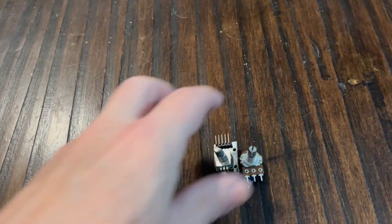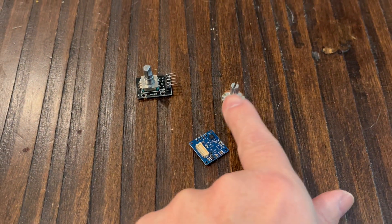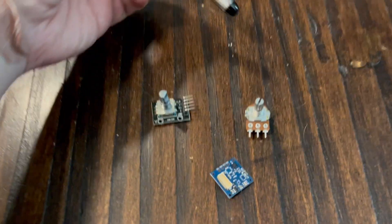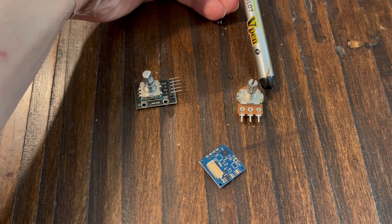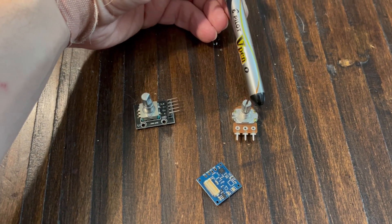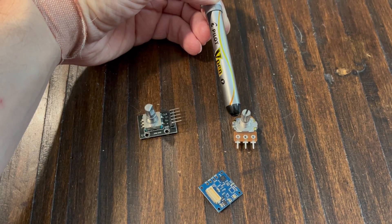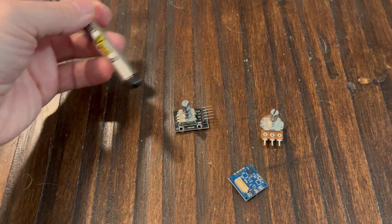So how you would use one of those is you would use a sensor, something like this. This is a potentiometer that's got a metal matrix resistor with a wiper arm. It's basically one big long resistor and that wiper arm touches the resistor and divides it as the knob is turned, giving you a different resistance as it's turned. That can be read by the microcontroller.